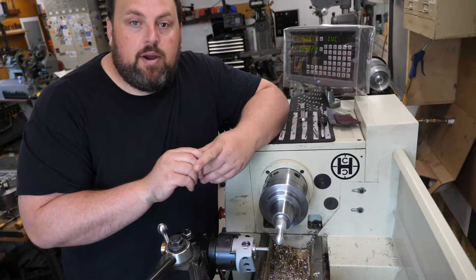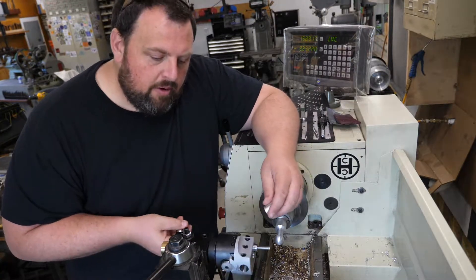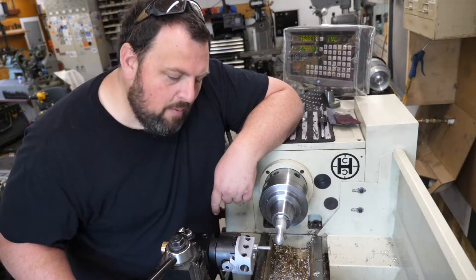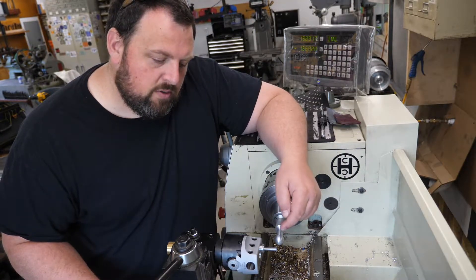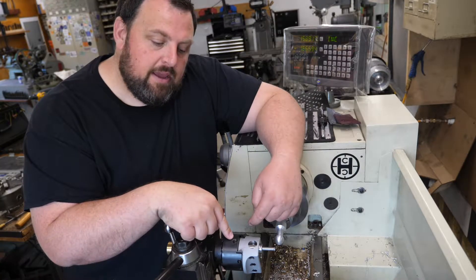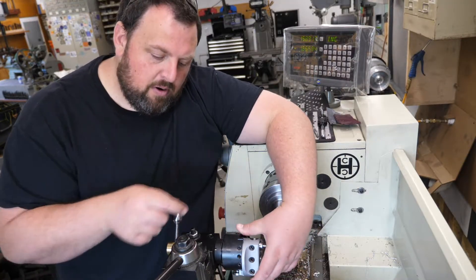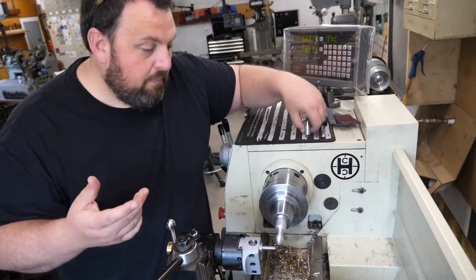Okay guys, let's get down to brass balls here — aluminum balls anyway. Setting this up can be a little bit tricky, so here's what I came up with. I turn it to center at three-quarter inch, that goes inside here and can be locked down so I can level it out with my tailstock center. Then I bring my Y in — after I face off the material, I use the center mark, bring the Y in to get it just this side of center, just towards myself of center. And then that screw that we drilled and tapped allows us access to bring this up and down. When you go to do this, make sure your boring bar is completely centered — not the bar itself, but this part of the unit centered on this part — that way you're getting the true center rotation in line with your tailstock. With those two things, I had really good results.